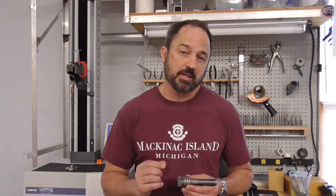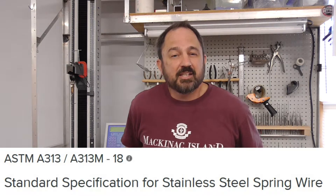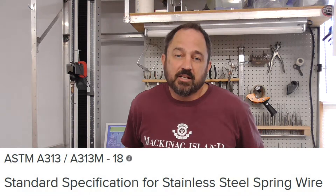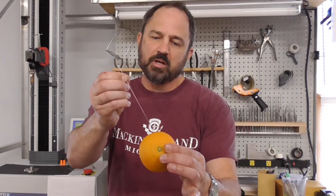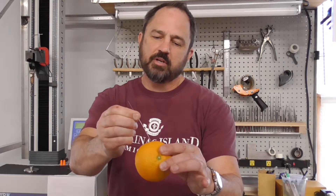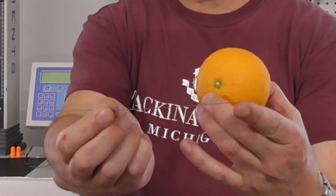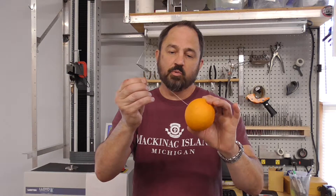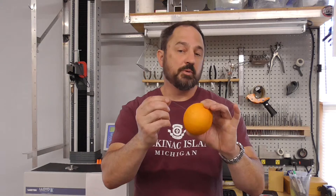Enough about how wonderful stainless steel is — is there a chink in the armor regarding breaking? Yes. Stainless steel, like many other metals, may become brittle when it goes through the processes that yield spring steel, stiffened steel. The stainless used in making medical devices like needle electrodes is indeed spring steel. We very much don't want a long needle buckling or bending as we drive it into tissue. So we better make sure that the steel in that needle is spring steel — very stiff. Just remember, when we make the wire slightly stiffer, it will not buckle as easily. However, it will be slightly more brittle, which means it can break easier.